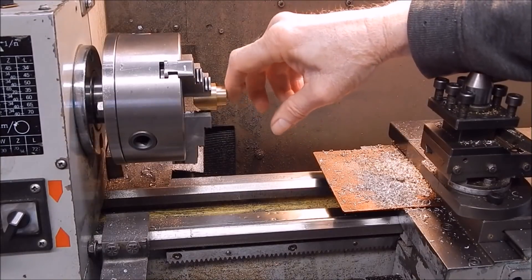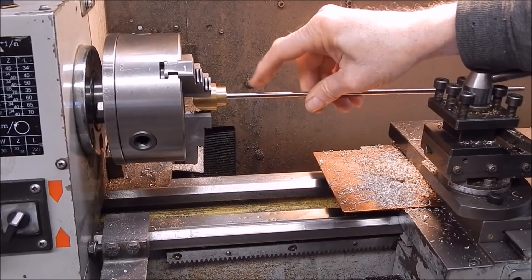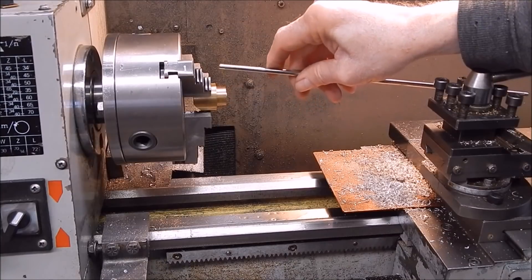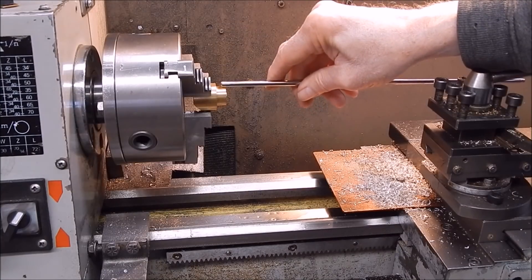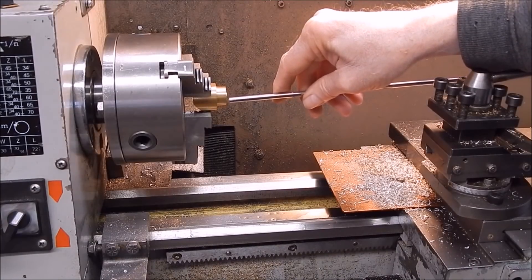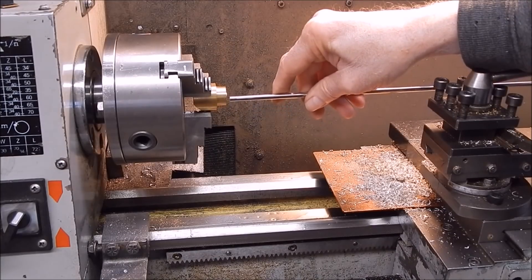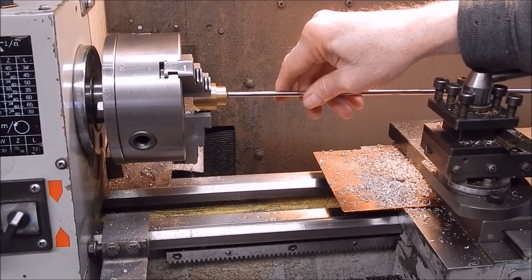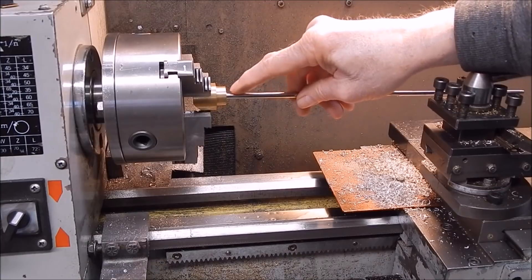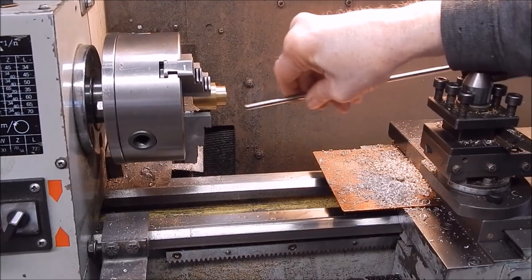I'm doing the flywheel. I have to drill the centre out to take this rod, and the problem is that this rod is just a bit under 6mm. I haven't got a drill the right size. I've got lots of drills — some just a bit bigger and some just a bit smaller, but neither are close enough. My end mills are exactly 6mm, so they're no good. The closest I can get isn't close enough to use a reamer, so I can't make up a reamer.